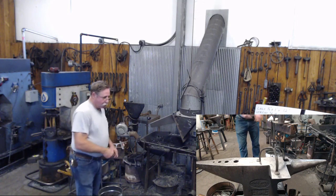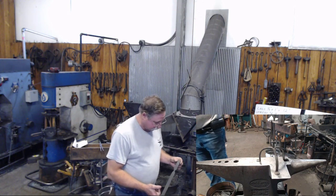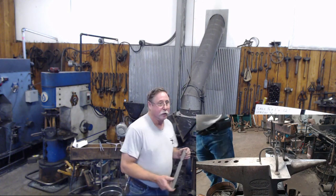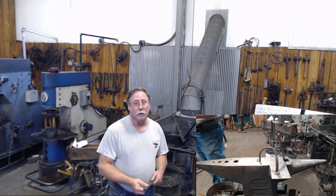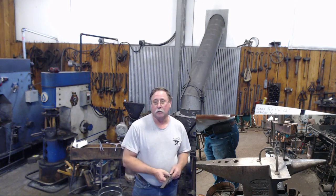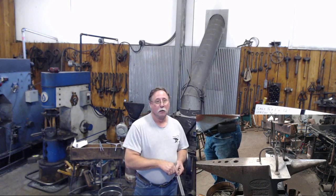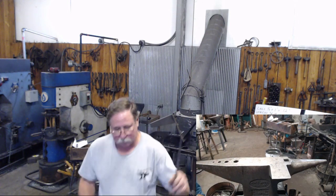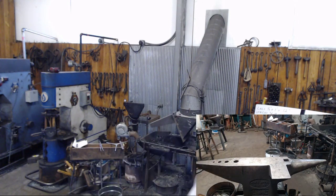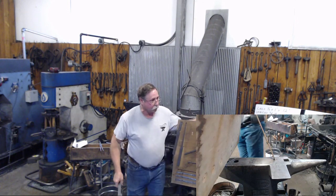What we decided on for class was to start with a piece of 1/4 inch by 1 inch by 12 inch long flat stock. And to alleviate all the cutting, all the hand slitting, we slit it in the middle, which will automatically form two of the legs. I guess I could set this up here while we're talking about it. This was the storyboard that we made for the class.